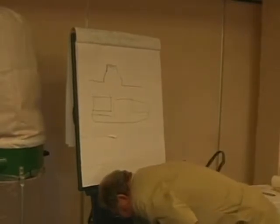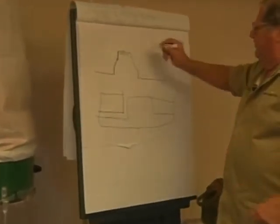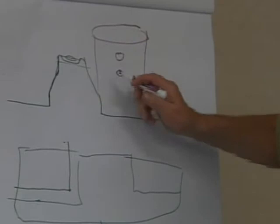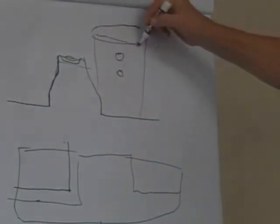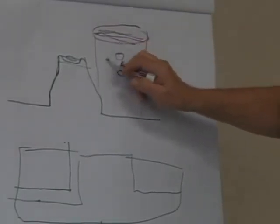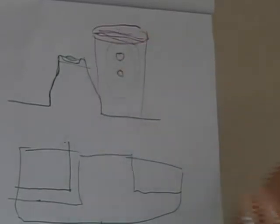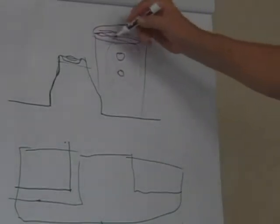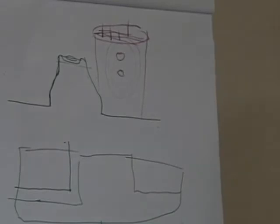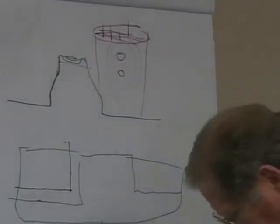you just pick out the fanciest grain. But let's say that you're doing it with straight grain wood. Now, if your wood is running this way, the grain in it, when you go to turn this round, you start doing this with the grain. So you take and actually kind of throw a frame around the holes. If you did it this way, that turns up on the sides, and this is just straight grain, which I don't think looks near as nice as being framed by that grain. So there's a lot of ways of taking and looking at what you're doing there before you ever get started.